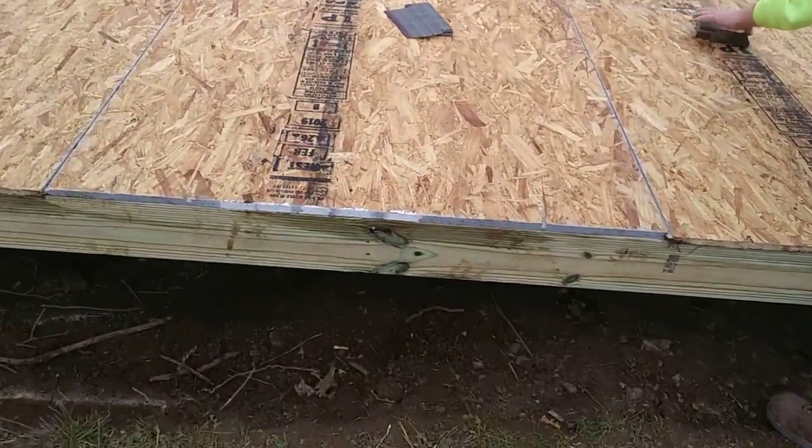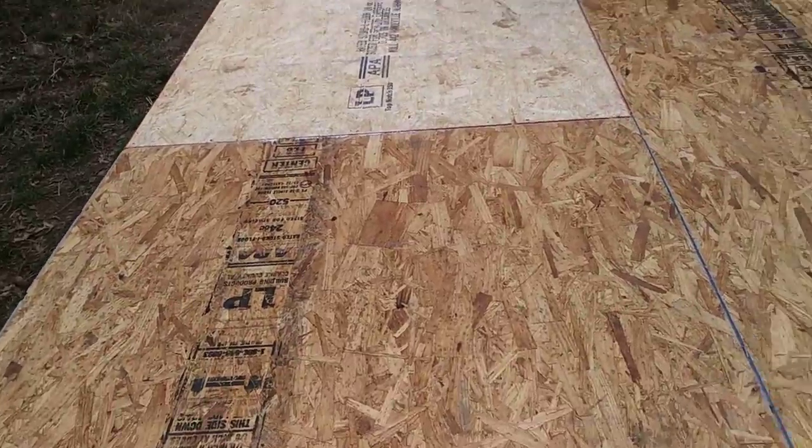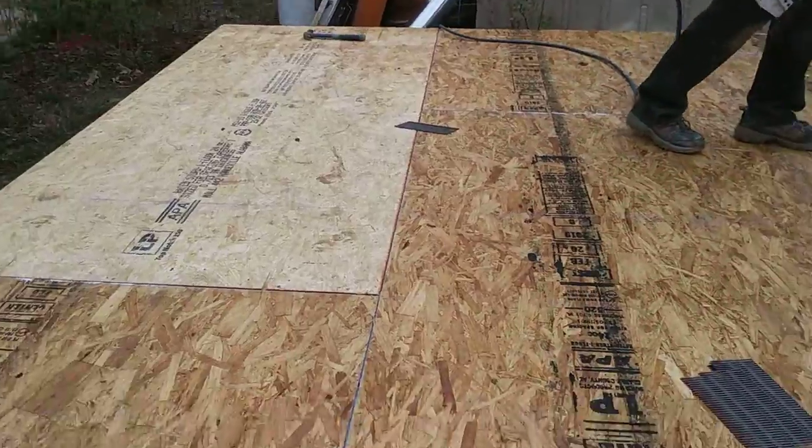He's a choice painter — they're chalking the top of it so they'll know what the studs are. They do a chalk line from end to end so you know where the studs are, and you just go straight up and down.